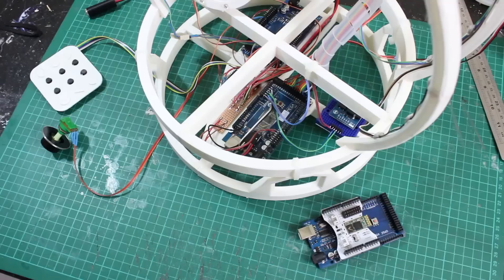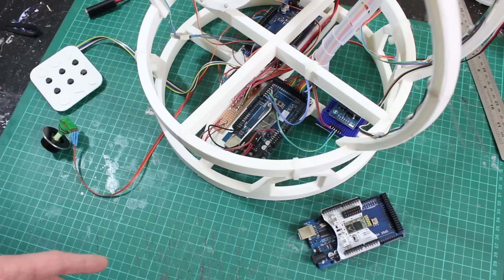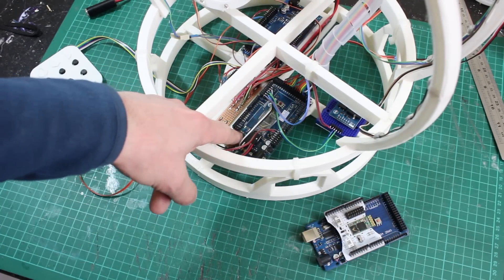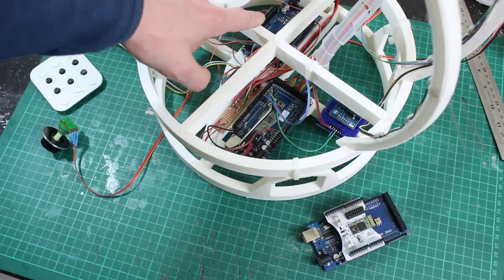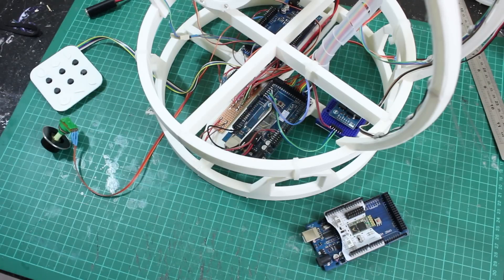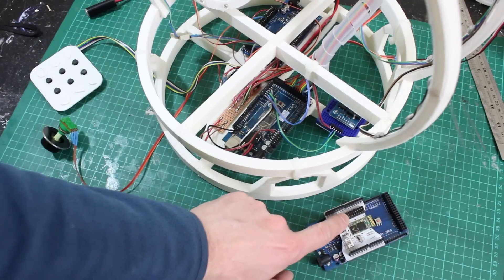We're going to start with something simpler — take a couple of sensors and try to drive one arm and work our way up from there. The motion capture suit has another Bluetooth device, and here's the shield it was set up to pair with, before I started using the bare HC-05 devices. We need somewhere to take that data and plug it into our Arduino that does reaction and reflex — the front one here. The back one does emotion control, so when in puppeteering mode I'm going to disconnect the serial lines from the other Arduino and add a switch that connects them to this shield instead.